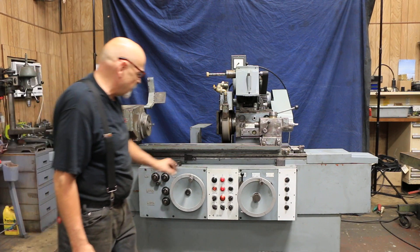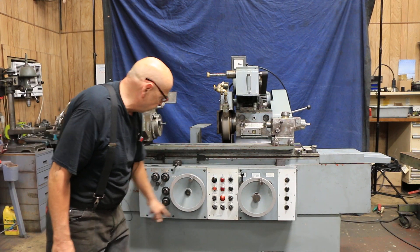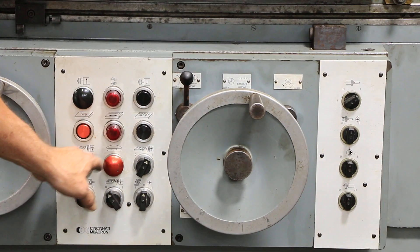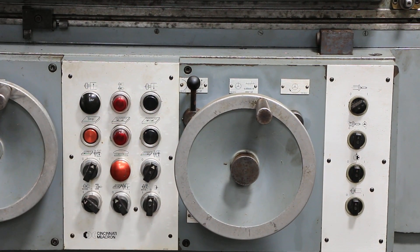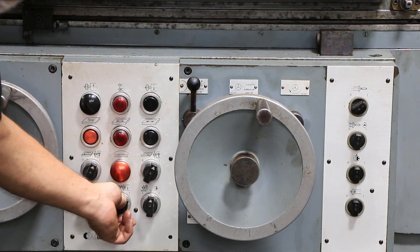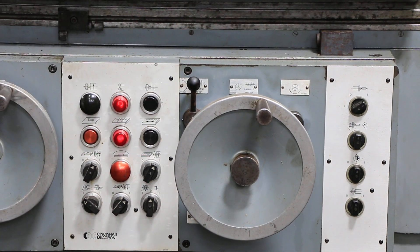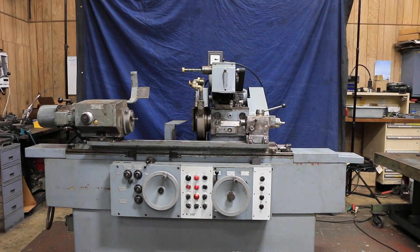Now when I want to stop this, I just go back here and stop my table. All these switches allow you to feed on the left side or the right side. Right now I'm feeding on both sides — I could shut one off and only feed at the head stock and not at the tail stock. I could select this bottom switch, which is more of an automatic: when I press the cycle start button, the table and the wheel slide will come in and start at the same time. So that's where you want it once you're in production.